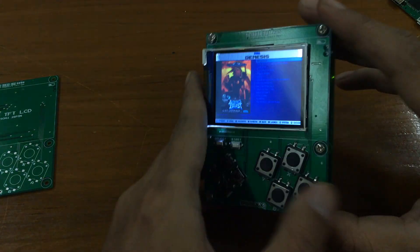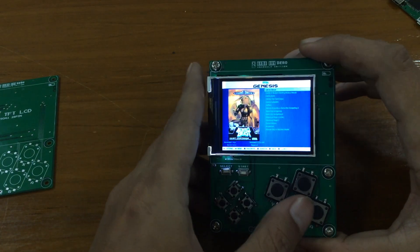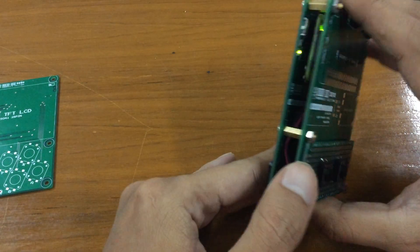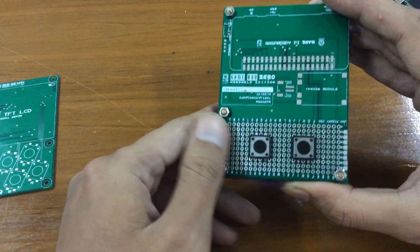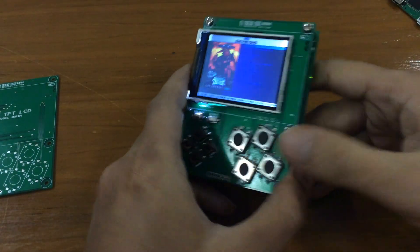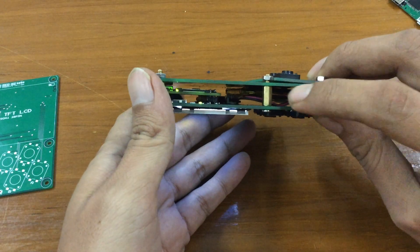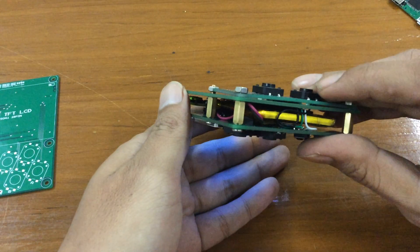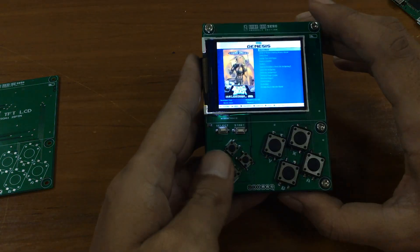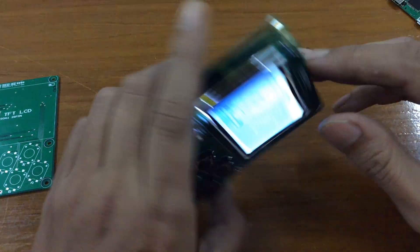My version: I got all the parts except the screen locally, and the screen I got from AliExpress. Because I didn't print the bottom layer, I use the top layer as the back and manually soldered a button as a trigger or shoulder button, and as you can see it works nicely. I put a 1000 milliamp battery in there with the Raspberry Pi Zero. It doesn't have sound yet — I will put the sound module later, perhaps if I have time for that.